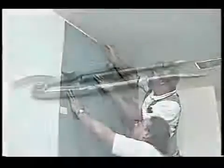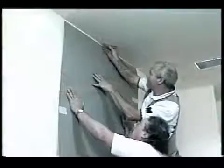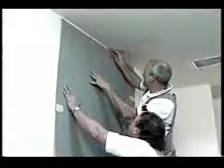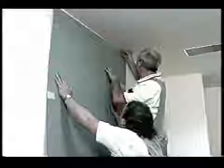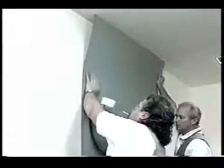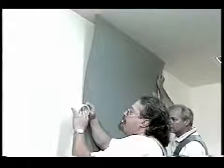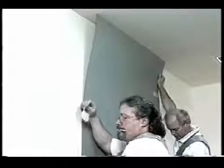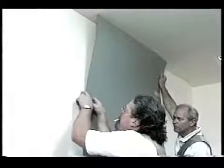In order to cut the sheet to fit any irregularities in the ceiling, we're using the divider tool to perform the direct scribe, which uses the divider tool to follow along the ceiling, tracing any hills or valleys in the ceiling, while at the same time creating a scribe mark into the bulletin board material. To do this, we must first set a reference mark to measure the distance we drop the piece down. Push the material up to the ceiling so it curls a little at the top.